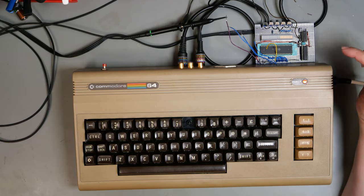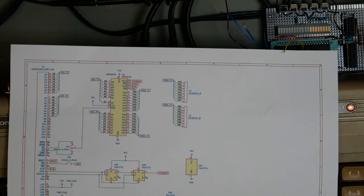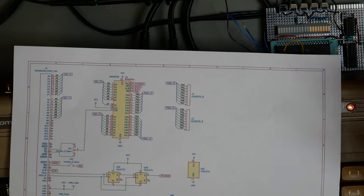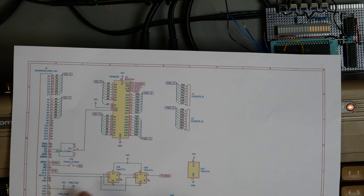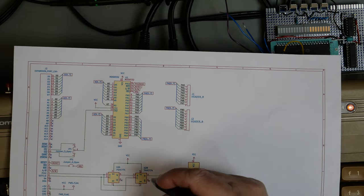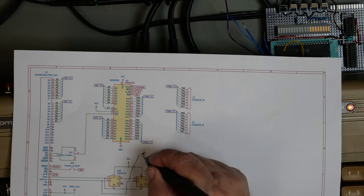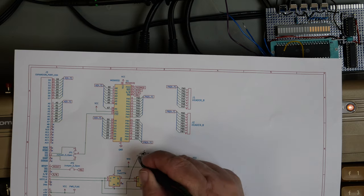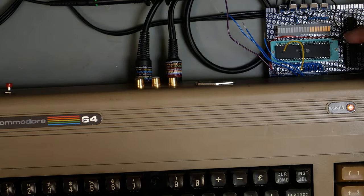He discovered that the flip-flop that I'm using, and the way I've got it rigged up, and I'll show you that, is in fact retarding the Phi 2 clock by 2 dot clock cycles instead of 1, and that is too much. So what I've done is I've taken off the signal from here, Phi 2 mod, and I'm feeding that into the Phi 2 input on the chip.